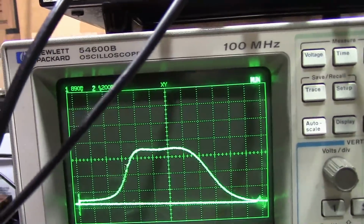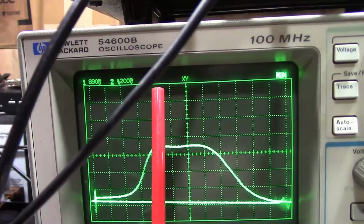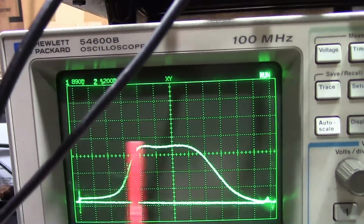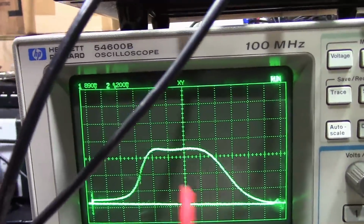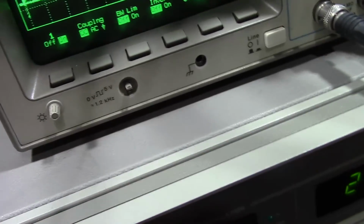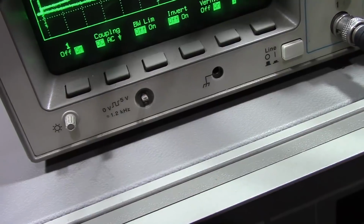So unlike, say, an AM radio where you want it to get the maximum gain at a very narrow frequency range, like around 455 kilohertz, TVs are different. You need a nice big wide bandwidth. Theoretically, the ideal is 4.5 megahertz. Set like this, they compromise a bit, so we're going from 22.1 to 27.